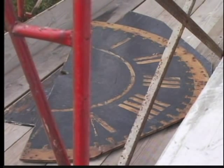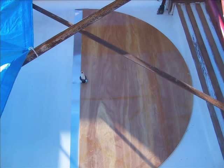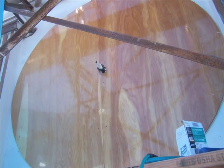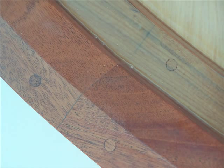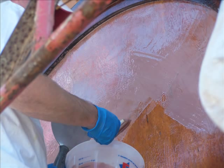It was losing time, dropping minutes — we had to do something. The clock face picture you saw was half of it. That was the process: we cut them out of large sheets of marine ply, they were epoxied, and then from that layer we put on two more layers to create the actual molding around the outside. What you see in black — those were made out of mahogany — we made those up and put them on, and then the painters epoxied the face so it's completely sealed.